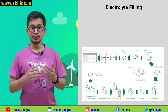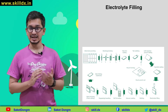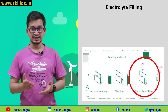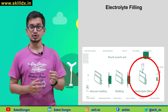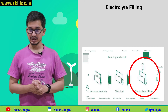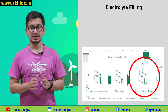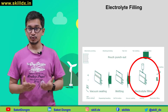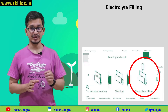For a pouch cell, it could be sealed by heating some materials and effectively making a hot glue connection. But after this initial sealing process, they still leave a small opening through which they can insert the electrolyte. The cell is first subjected to a vacuum through this small opening, which removes most of the air from the inside of the cell and from the pores in the porous electrode structure. Then a small amount of electrolyte is injected and the vacuum is released so that atmospheric pressure forces the electrolyte into those small pores. This can be done multiple times so that the electrode porous structure is filled as fully as possible.